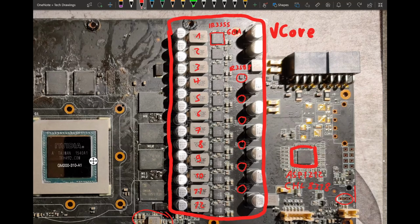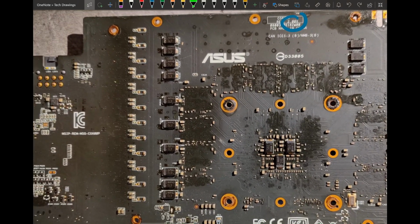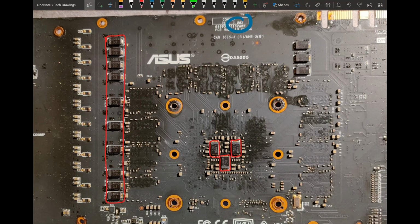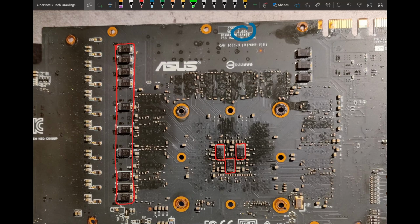But usually on a fairly high-end card, which such is a Strix, you do want to see some more capacitors, and that's exactly what we're getting, because we are getting a number of 470 microfarad SMD polymer capacitors as well, including, which is very nice, I've only seen Gigabyte do this, but now I've also seen, at least on this card, that ASUS does it, 560 microfarad capacitors behind the core, which on the reference model are either 470 or 330. So yeah, we also have directly behind the core a small capacitor upgrade, which can potentially help.